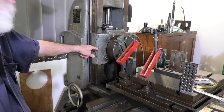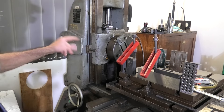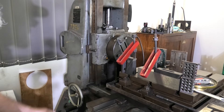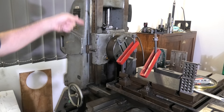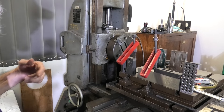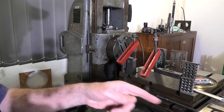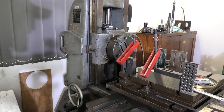On the side of the gearbox we have a clamp either side that clamps onto the strip. Undo those clamps, crank the hand wheel and the head goes up and down. It's got just over 12 inches or 300mm vertical travel, about 350mm crosswise, and I think 450mm longitudinal. All up, you can work on and face an 18-inch cube — that's what it was built around.